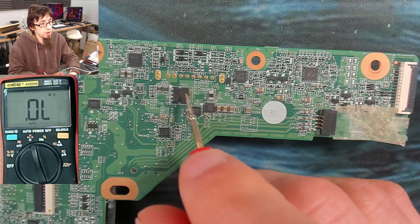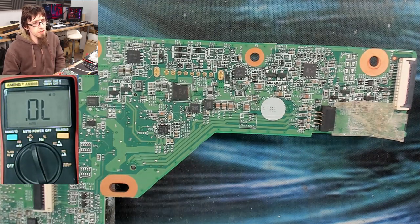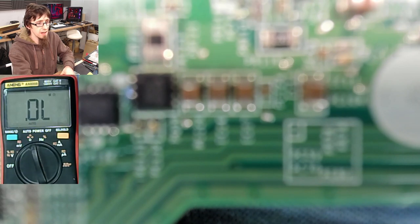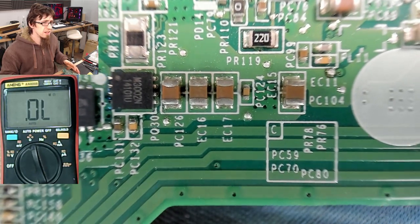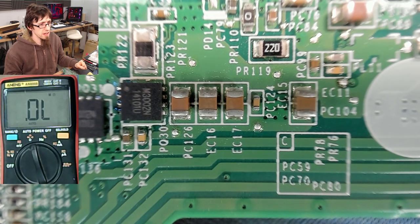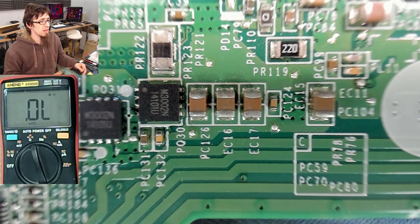We can determine there's no fault in this area — it's almost certainly not the battery charger. We've got some capacitors here. To be honest, if this was a bad capacitor I'd expect to be seeing zero ohms. I'm looking for MOSFETs with these symptoms. Those guys look a little bit spotty in the center but it's really hard to tell. Every time you look at capacitors, you only know when you find the bad one. Could be — who knows. Let's look for other stuff first.